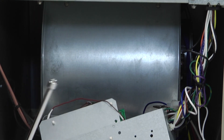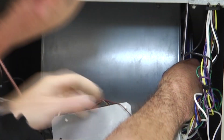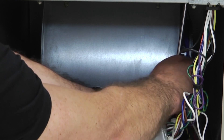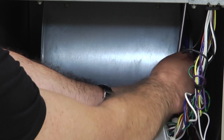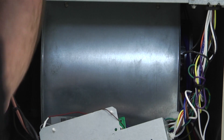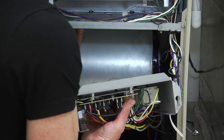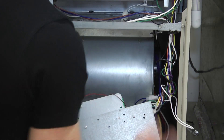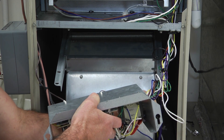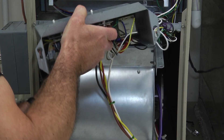There's one screw removed, and there's two. Once I've got those two screws removed, I'm able to slide that blower assembly toward me, or out. Just be careful of the wiring — you're going to have a couple of things you're going to need to disconnect. Disconnect your limits, and slide that right up.